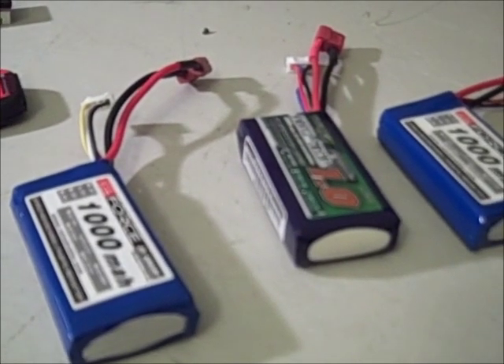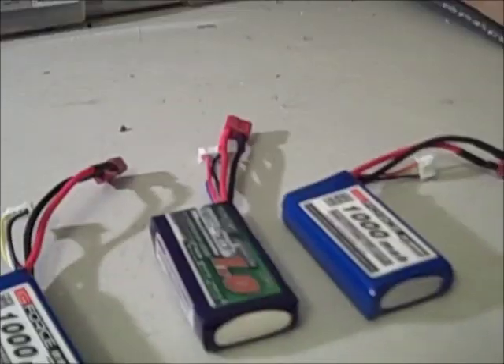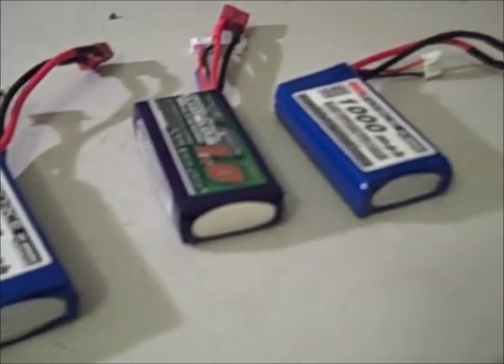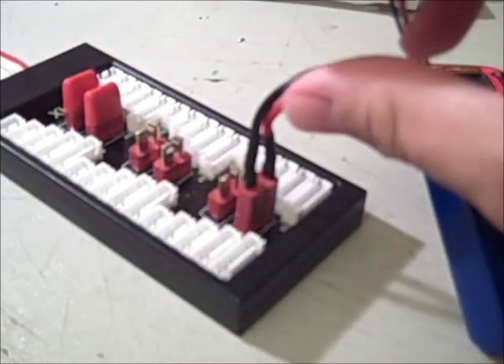All of these I know are about 3.8 volts per cell, where I like to store them. You can't have a battery that's at 4.1 volts and one that's at 3.3, because the capacities are technically either half full or half empty. The problem you run into is that the charger is trying to balance all three packs, so you want them as close as you can get them.